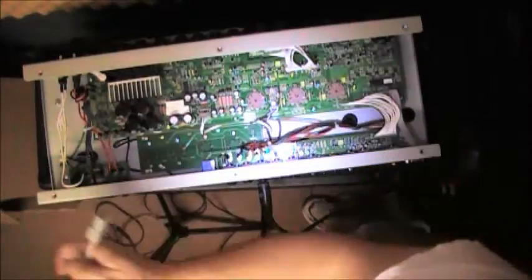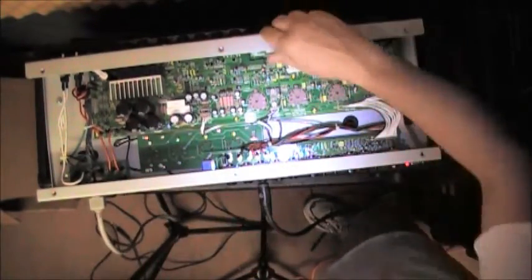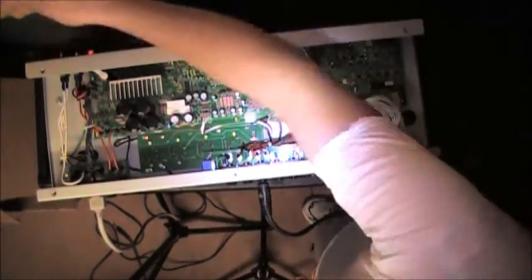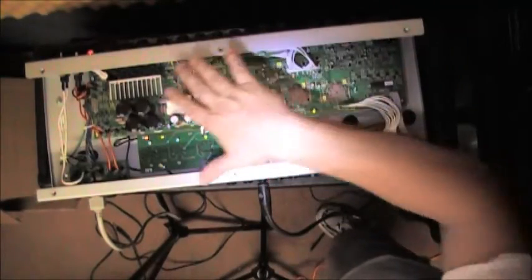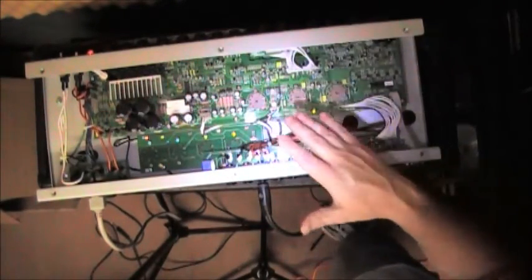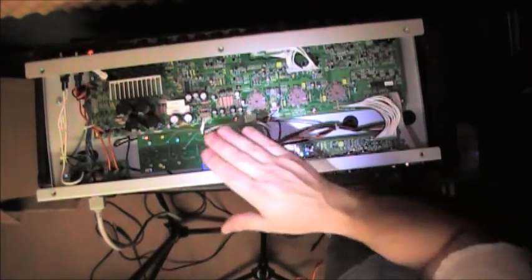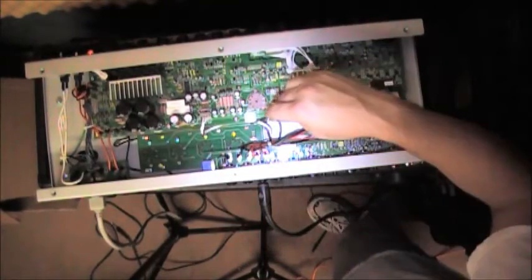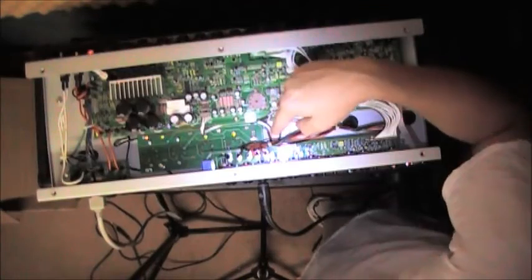Cable. This is the bad boy. So it's unplugged. What I'm going to do right now is I'm going to go ahead and plug it in, and this is the first time I've powered up these new tubes, so anything could happen. Hey, nothing happened so far. Right now I'm just going to let these cook for about 10 minutes. I'm just going to let it warm up, and we'll take it out of standby when I get ready to bias it.